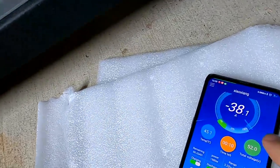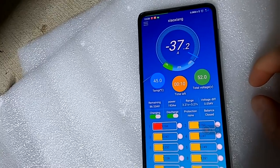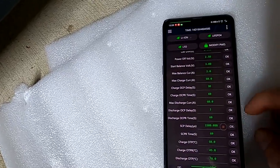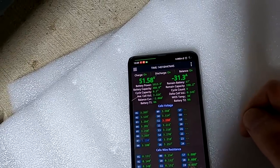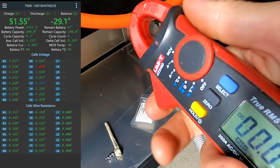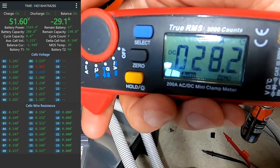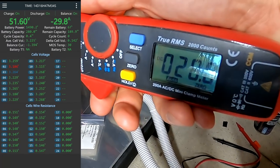3, 2, oh, it's on, we are live, and immediately we can see a reduction by about 30 amps here on the old battery now. So if we go back in the new one, we should see, yep, the other 30 amps are coming from this battery now. Man, we are up and running. The two batteries are sharing the load now. Yeah, we always want to see some amps flowing, right? Yeah, this one shows us 27, 28 as well. Perfect. So this is all good.